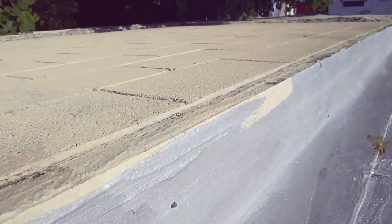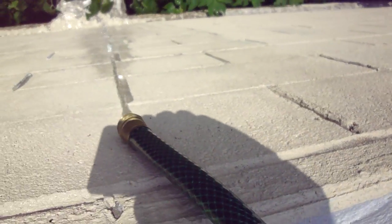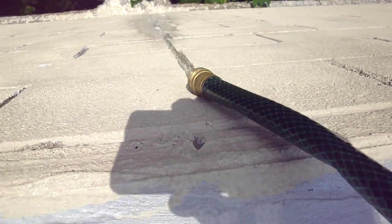So they just filled in this back with a block wall and they didn't really waterproof it enough — they just put a coat of paint on it thinking that was enough, and it isn't. That paint is not enough to keep moisture out. To compound it, after the block wall gets wet, the water gets inside the block wall, goes down and hits the top of that brick which is more dense, and it stops and starts spreading back in towards the house.